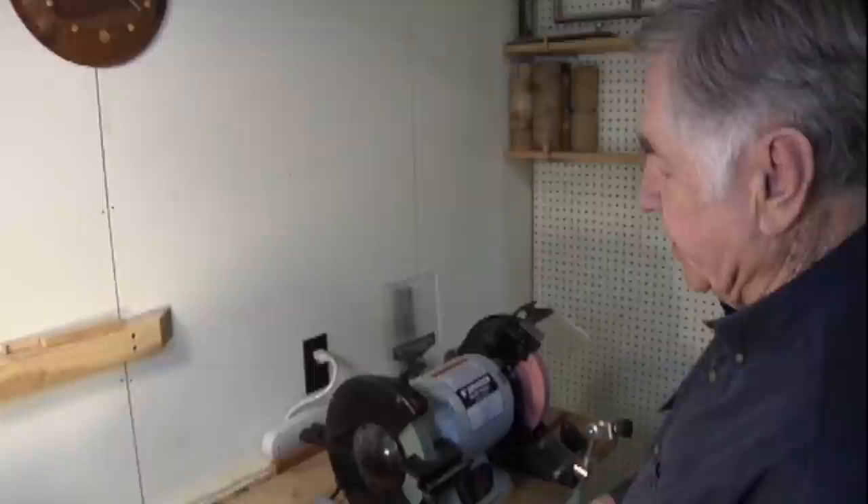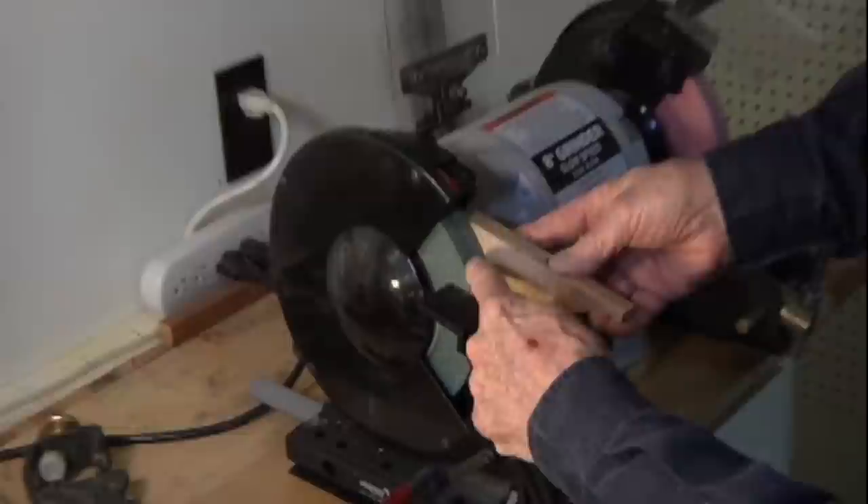What I've done in order to make these — if I wanted a 60-degree one, I come and draw an arc, cut it out on the bandsaw, and then I relieve it in here so that it will compensate for wheel wear. That's how I get repeatability on an adjustable tool rest.